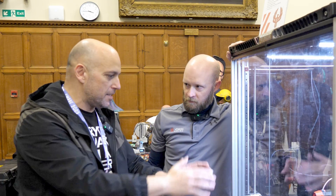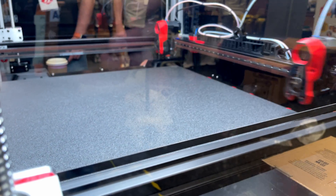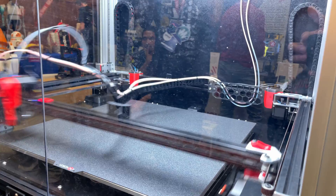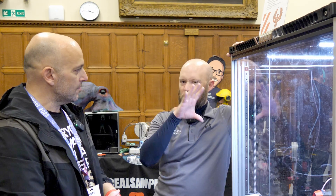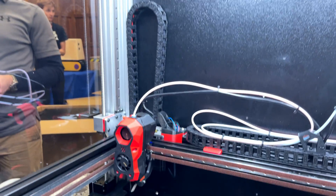The heat bed — it's four independent 300mm by 300mm heat beds, each with an independent heater. The reason is two-fold: getting a single 600mm square slab of aluminum to stay flat over time as you thermally cycle it is going to be really difficult, so this allows more modularity. Also, in the US we're typically on a 15-amp circuit at 110 volts, so we have to stagger heat-ups. With four heaters you can bring one bed up to temperature, then the next, sequentially, so you don't risk popping breakers.